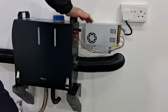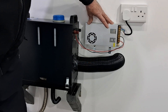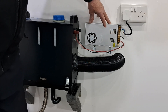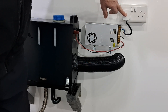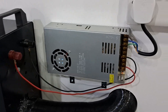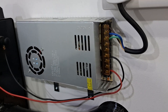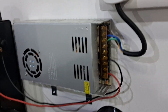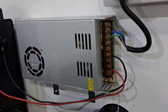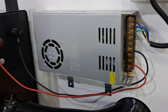So we're back in the garage. I'll show you my setup. You do need a 12-volt power source — I use one of these 12-volt power supplies which converts the mains power into 12 volt, which the heater needs. They're quite easy to set up; it's just like wiring a plug really — three wires in including the earth, and you just have two wires coming out: a live and a negative.